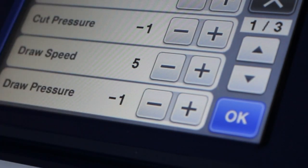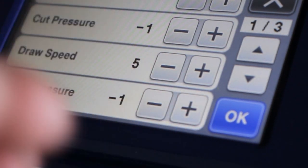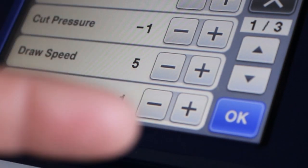Therefore, I am going to make multiple passes through this, all right? Yes, it's a deep cut blade. Yes, it's thin material. I don't care. It's still metal. So I'm going to take my time cutting through this. If I don't, what risk I run is that blade catching and ripping that metal. When that happens, it is inside my machine.